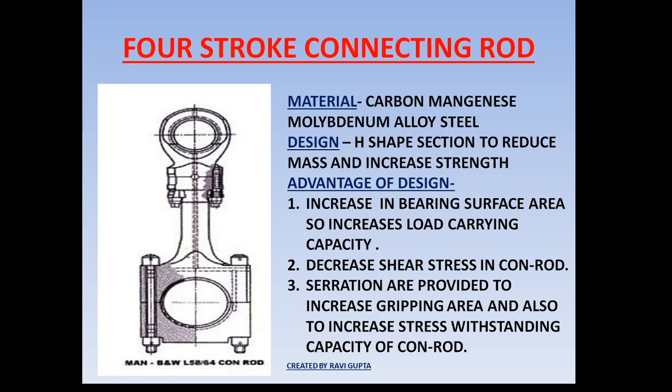As we increase the bottom part width, in high-capacity generators the widened bottom part will not come out when pulling out the piston with the conrod. In that case, the piston uses a palm-end type design. With the palm end, we remove the palm-end nut and the piston with the gudgeon pin and the top part of the conrod come out, while the bottom part of the conrod is taken out separately.